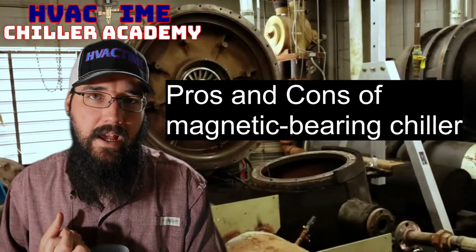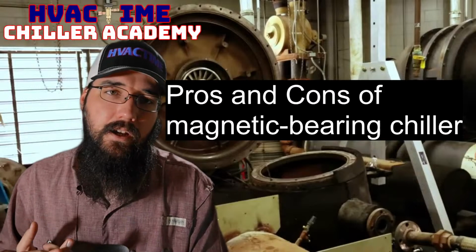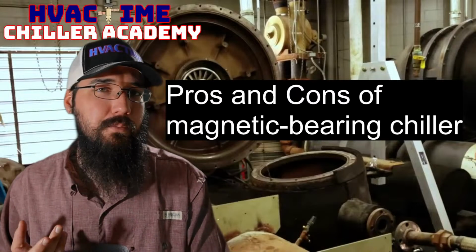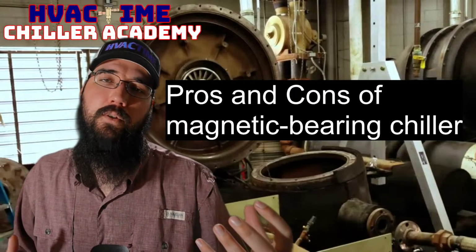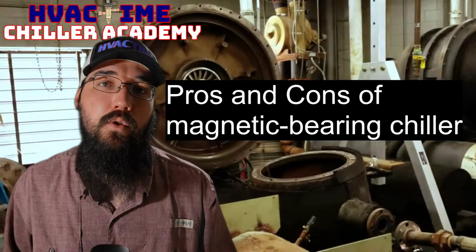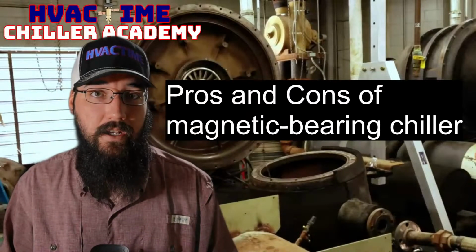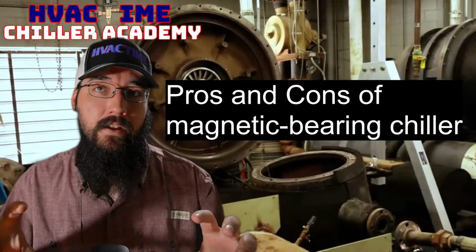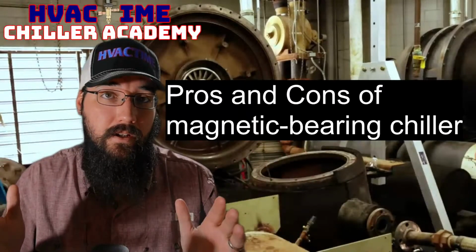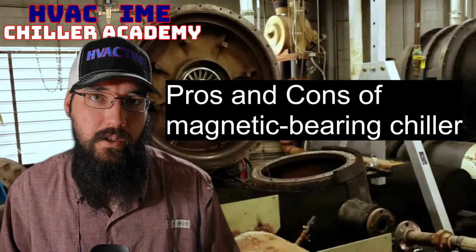We haven't had very good results with bearing life. I just thought of another one I should add: they're just very sensitive to the electrical grids. Technicians being able to work on them requires not only having the software, but knowing what to do with that software. You've got to be very specific and precise, because it's like a turbo core, for example. If you don't do that bearing calibration just right, and you end up accidentally saving a bad calibration into that compressor, it can be fixed, don't get me wrong, but it's a pain. You dug yourself a hole when you were actually better off with the first calibration you started with.